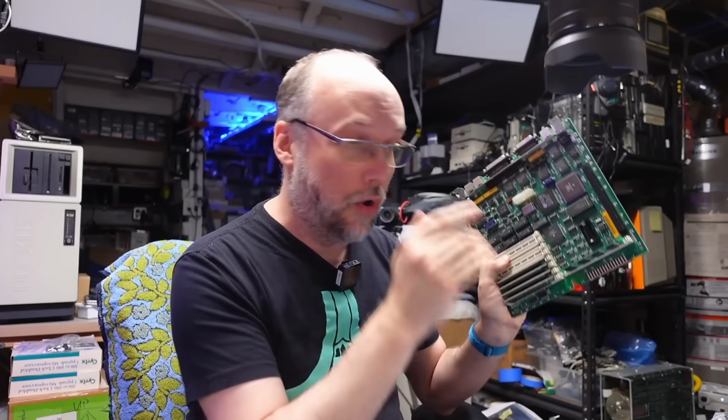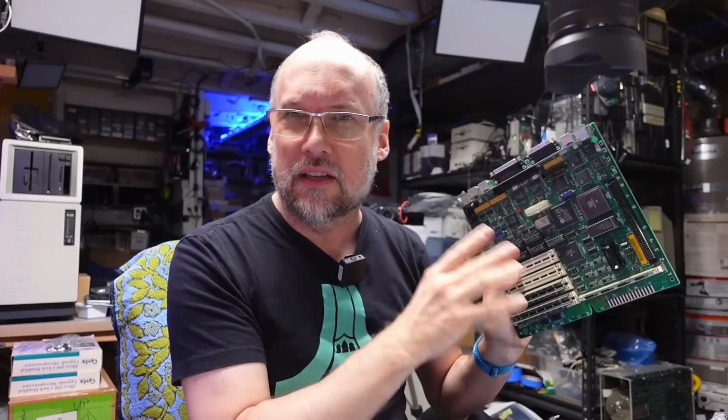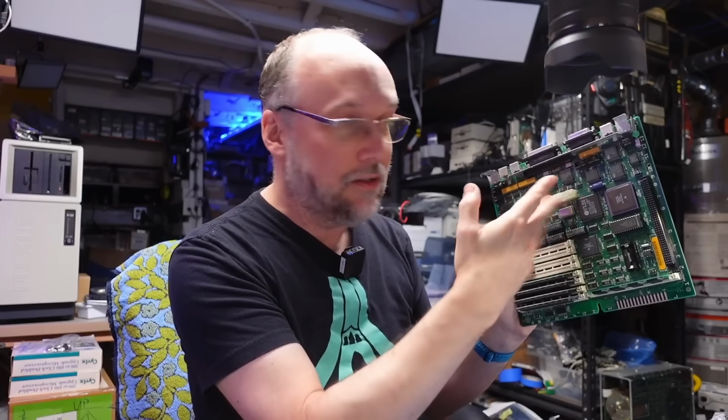The main one, of course, when you plug it into power, you get a sad Mac tone, just like the other one, the one that got damaged with the 12 volts. But the other weird thing that's happening with this one is the video, at least through the RGB to HDMI, is flashing repeatedly, which is kind of strange. I haven't actually tried this inside an actual Mac chassis, but my assumption is the RGB to HDMI is kind of unhappy with the video signal, but we're seeing the video signal, it just is flashing. It means there's something going on with this board besides the sad Mac tone.